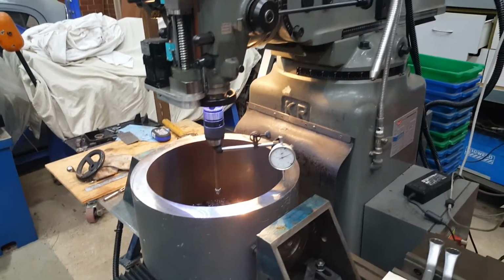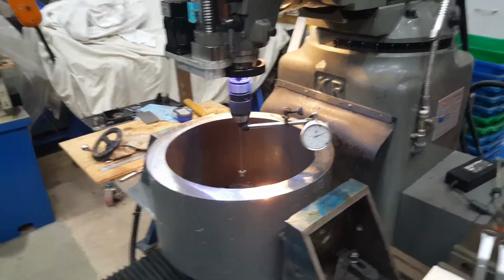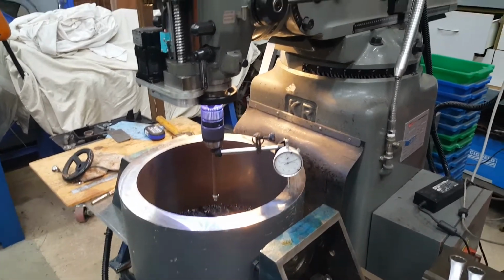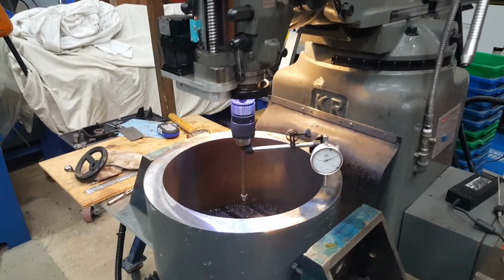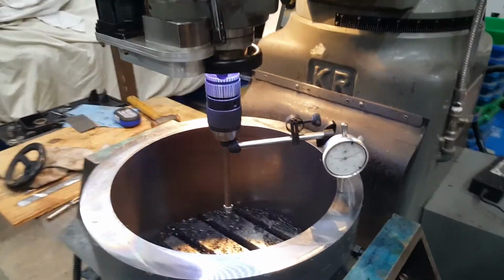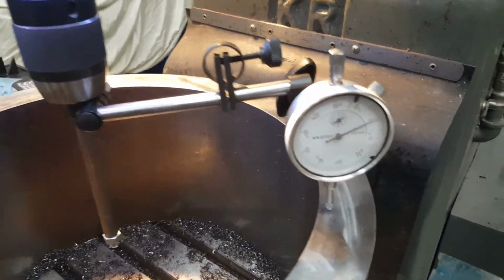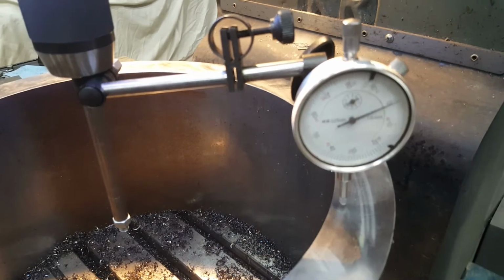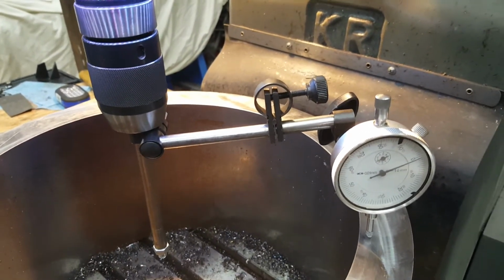After getting the turret back on my mill, I need to tram the head because I altered the tilt on the head. I don't know that I altered the nod, but this method is quite accurate, and I've adjusted both the nod and the tilt of the head. You see this little dial indicator set up on a shaft in the chuck.